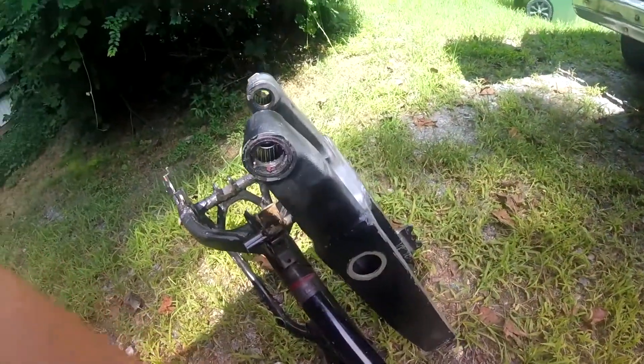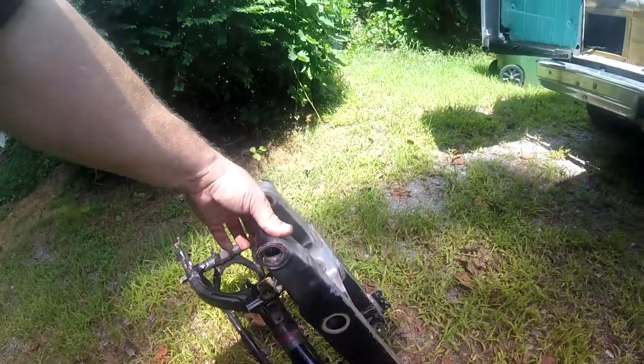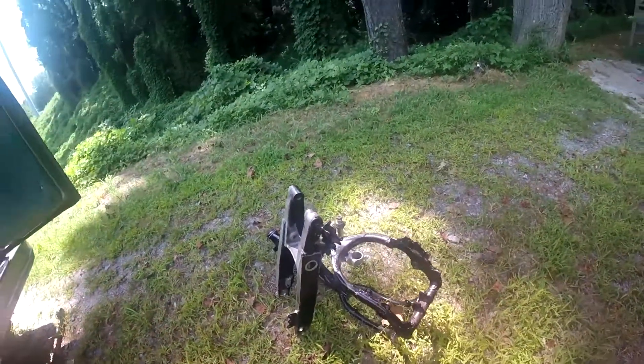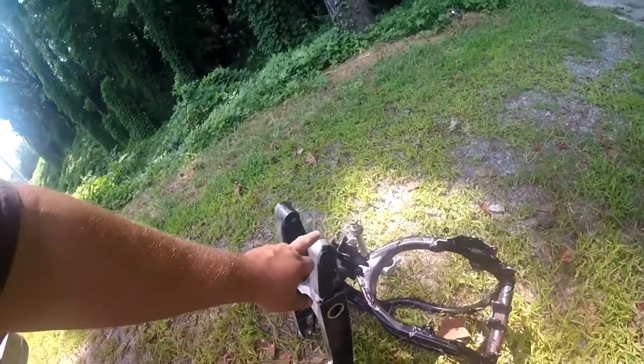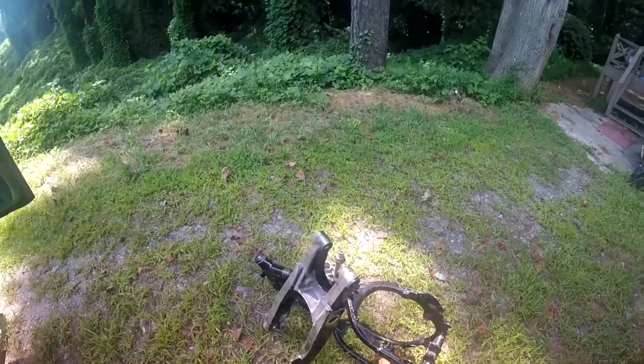Same thing with the swing arm. I'm just going to let him blast right there on the bearings, and then I'll press them out and replace them. It'll get new bearings because when he blasts it'll ruin those. But that's okay, because then I'll have nice good clean bores inside that casting to work with. So it's just a matter of a little bit of forethought and prep work.